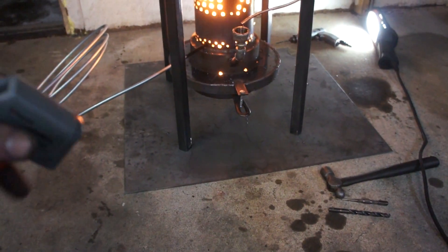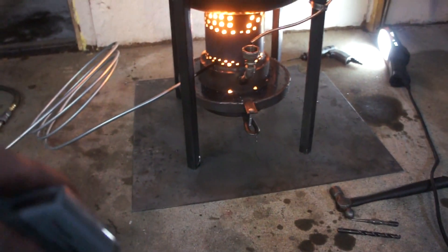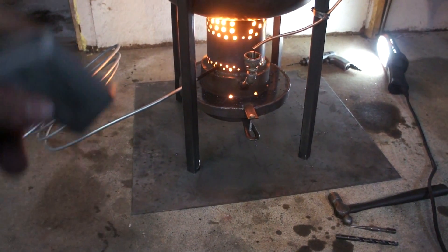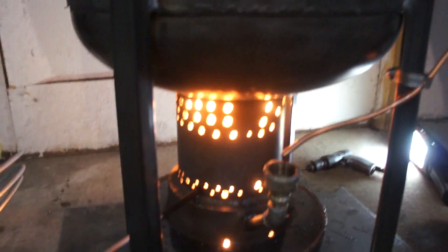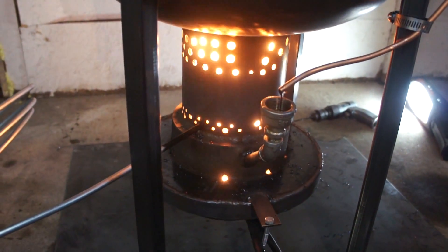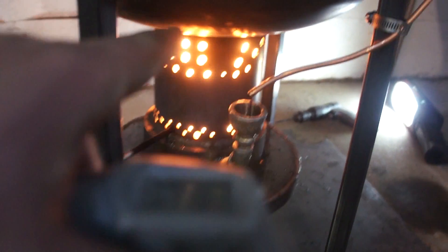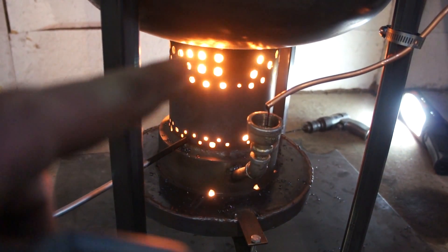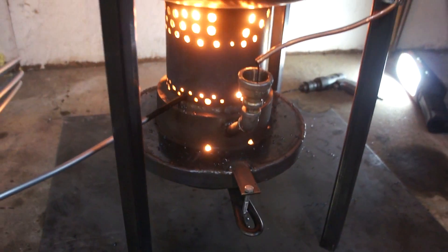I got it sealed well enough that if I poured gasoline right in the pan, lit it on fire, and stuck the pan in there like it is, the fire would go out. So I started drilling holes until I got a pretty good flame. My hole sizes are kind of all different — I'm just drilling my holes out a little bit bigger and a little bit bigger. My upper row of holes are up to three-eighths, the lower row of holes is quarter inch.